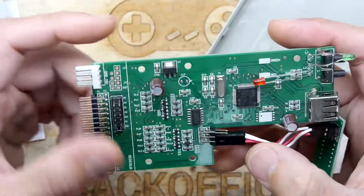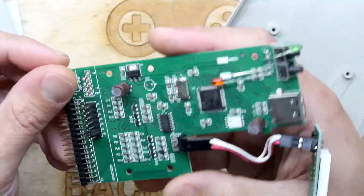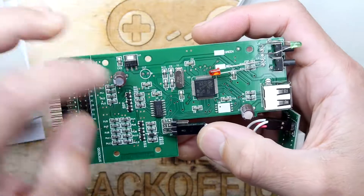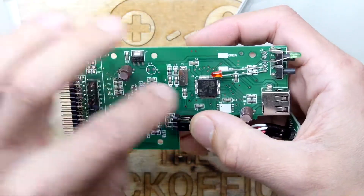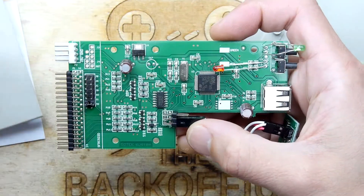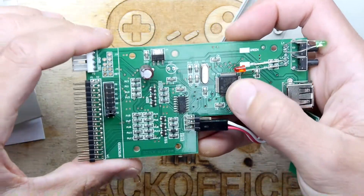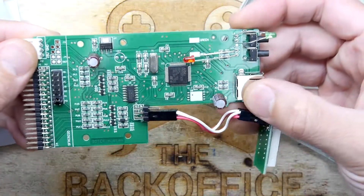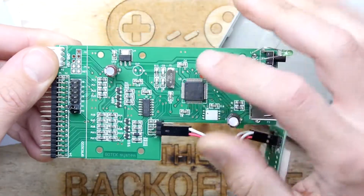The chip is the STM32F105 — it's actually a pretty standard chip. If you look at a Bluepill Cortex board, for example, it's similar to that family. It has an onboard bootloader, so when you put the boot pin here you're setting it to bootloader mode, which allows it to upload its software via serial, because this doesn't have USB fitted to it.